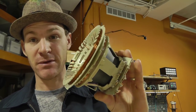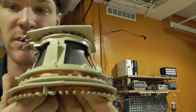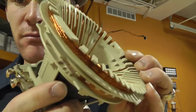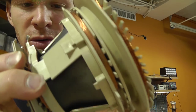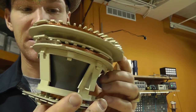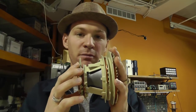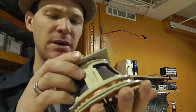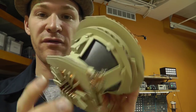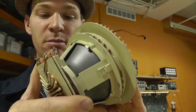So this is what it is. What is this you say? It's just a standard TV yoke. But here's what's special about this so-called standard TV yoke. This is the only one I've ever seen like this in this style. This is for a big CRT monitor, probably a 20-inch, maybe a little smaller. Basically, the ferrite core is one solid piece.